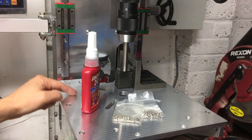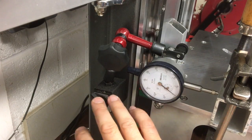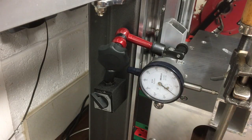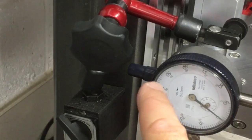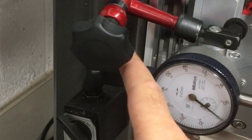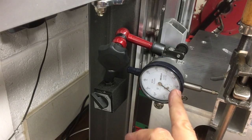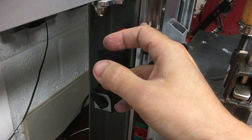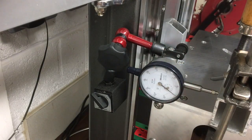Down the side there is daylight in a few places because the box section is not flat, meaning the screws holding this plate on are not super tight, so I want to get that torqued up. We've got our M5 grub screws to lock the whole system in place with Loctite. I've got a DTI set up to make sure when I put the grub screws in, this doesn't move — in other words I'm not moving the rail.